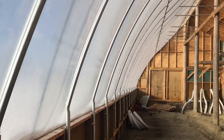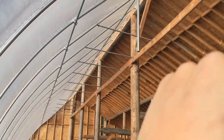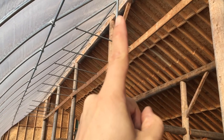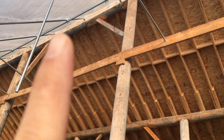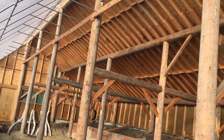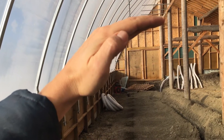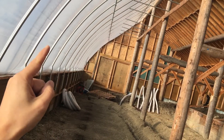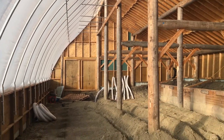This front wall was actually a bit of an interesting consideration. The greenhouse itself is a 50-foot-long greenhouse that's cut in half right along the ridge line. I took a grinding saw and cut all these last pieces all the way along and then used joist hangers to attach them. I took the 50-foot-long, 30-foot-wide greenhouse and cut it in half to make it a hundred feet long and 15 feet wide. The greenhouse was at a shallower angle and I wanted it steeper for shedding snow, so I turned it up. It wasn't pre-engineered — it was a bit of an organic design.